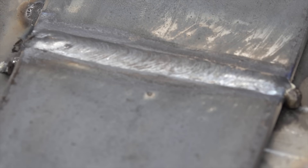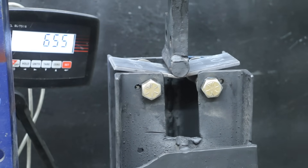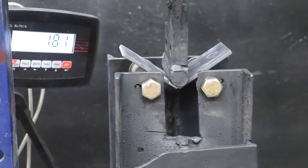With the Deco, the hot start is good and it's offering consistent heat right out of the gate — definitely a more consistent arc than previous brands. Running at about 147 amps, the Deco made a nice weld with the best penetration yet at 2.15mm. On the strength tester, the Deco reached 689 pounds before folding — more than twice the strength of the S7.